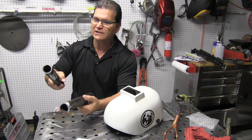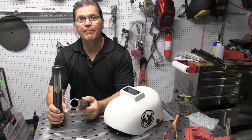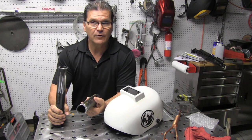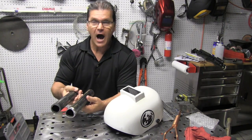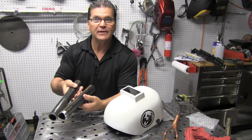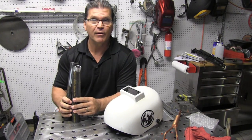So I cleaned it down to clean bright metal. Remember that phrase — clean bright metal. That's what you want to TIG weld: clean bright metal. In the case of hot rolled steel or pipe like this with a coating on it, you want to remove everything and get down to clean bright metal.